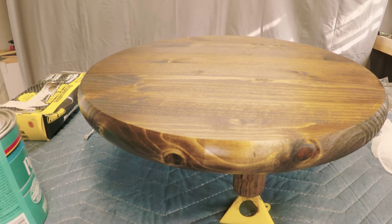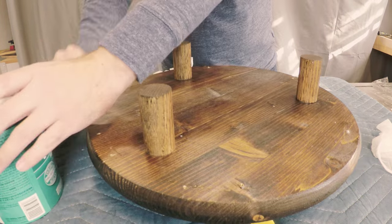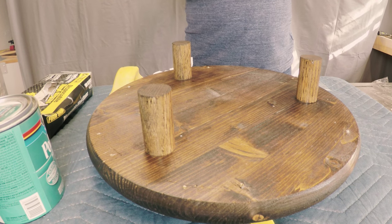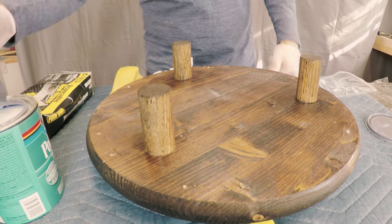Here, I am using a water-based polyurethane, coating the base with at least 2 coats. I sand the base, remove anything left over from the stain, and use a wide foam brush to coat the wood. If you see bubbles from the finish, you are moving too fast and need to slow down to prevent them.